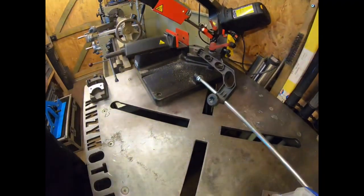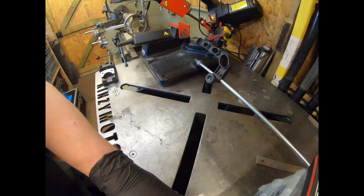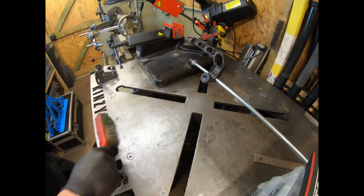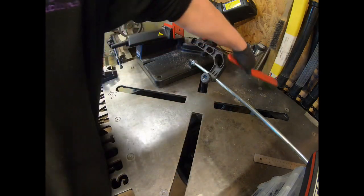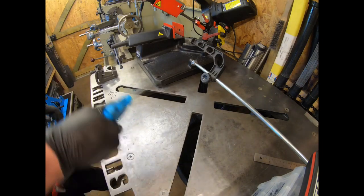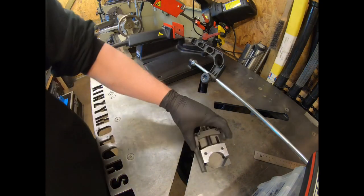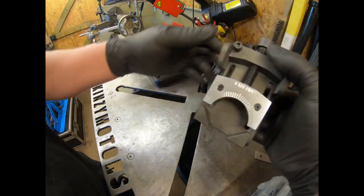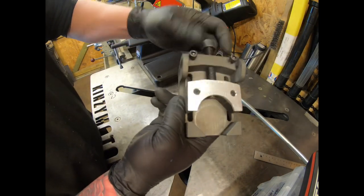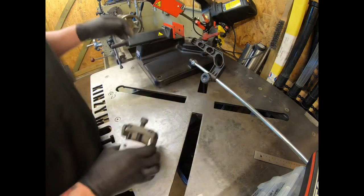So we're going to put you here and I'll show you the process of making cuts in the bandsaw using the LPSFAB jig. Let's just clean this bench down a bit. So there's the jig that I showed you before. We did the degree ring, and this has got the 1¼-inch pipe plate on there. That adjusts it in and out, and then here's your angles on the side. So we're at 15 degrees and on the 1¼.